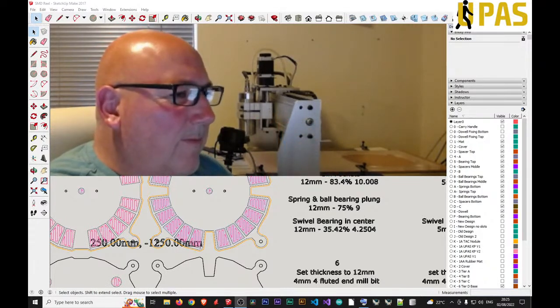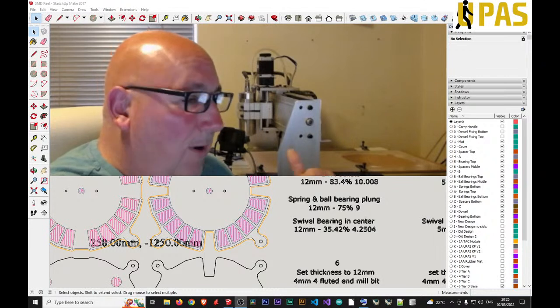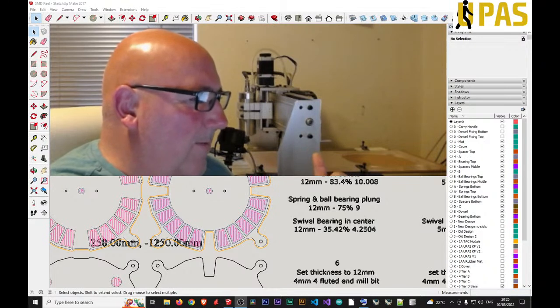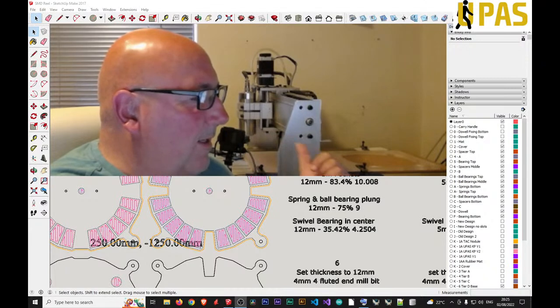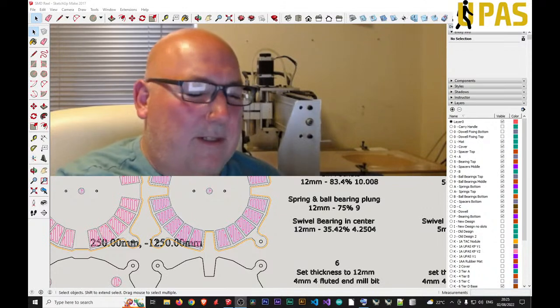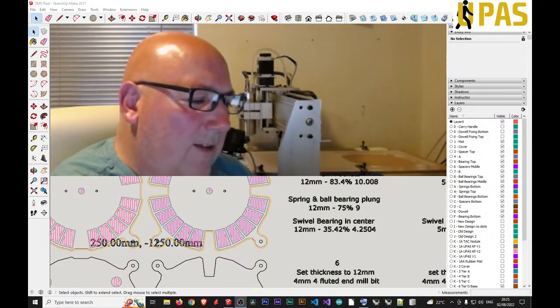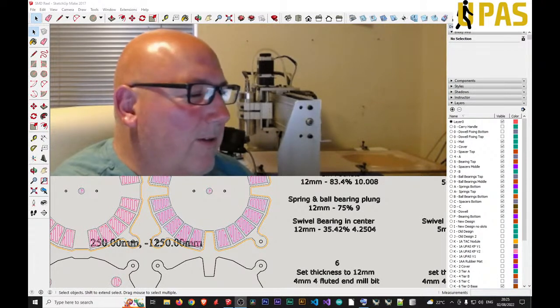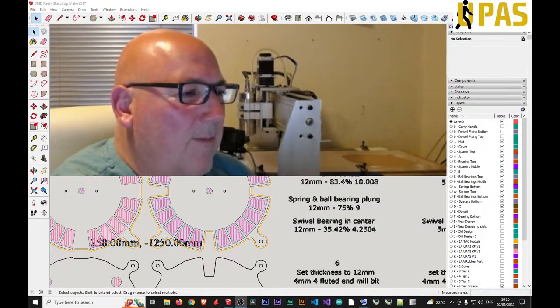There's no real adjustment on it. A lot of people buy a piece of billet aluminium the same size as the bed, about 8 to 10mm thick, bolt it on, screw it to the bed, then face it off — and then they've got a known good standard. As the years go on I'm getting cynical, but I think the mistake was built in.